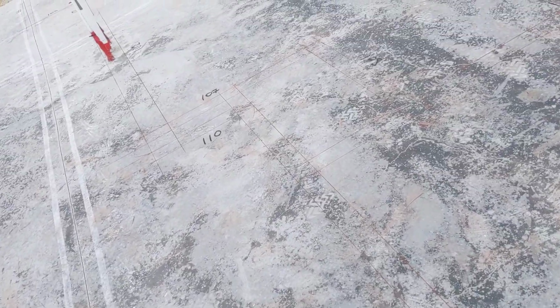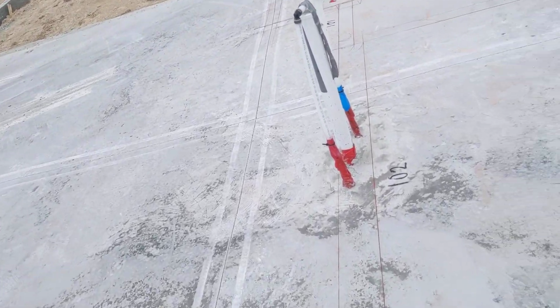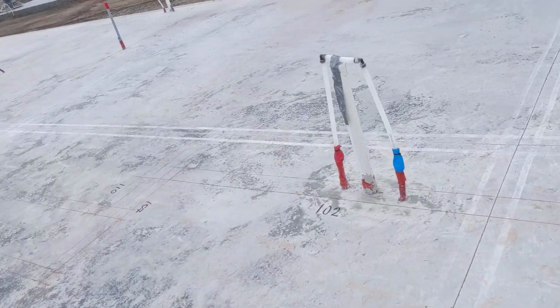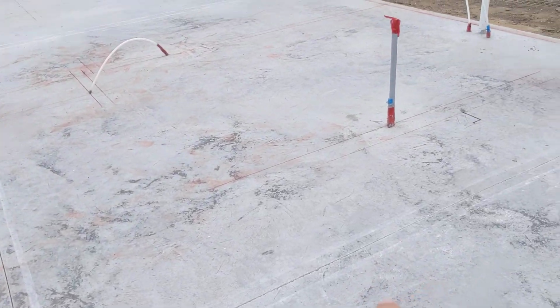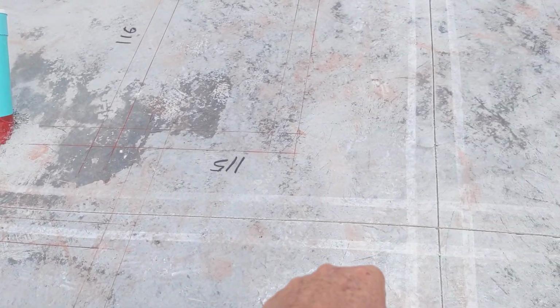All right, so they're called control joints, and the engineer on the print shows us where to put them. So the reason for control joints, what are they controlling? They're controlling cracks. Okay, concrete's a wonderful product to build. It's absolutely wonderful. You could form it, you could shape it, you do all kinds of stuff with it. But it does crack. And so a long time ago, engineers found out if you just run a control joint, so take the saw, there's Jose, he is the grande jefe of the, and you cut a saw joint right along there, any cracks will stop right there. So let me talk with the good looking fella.